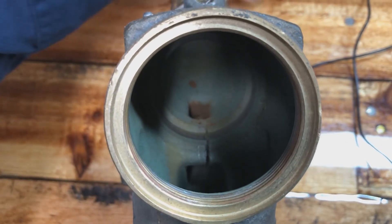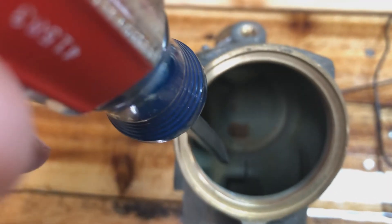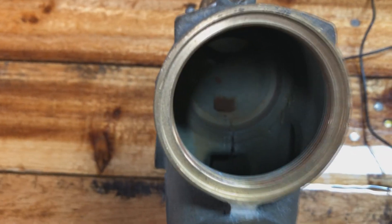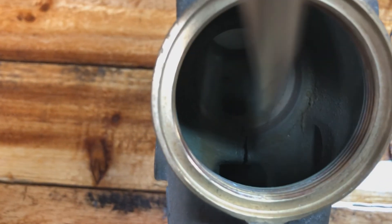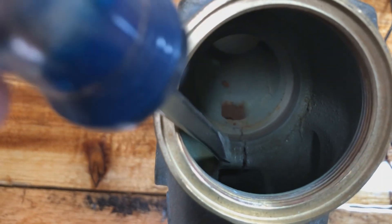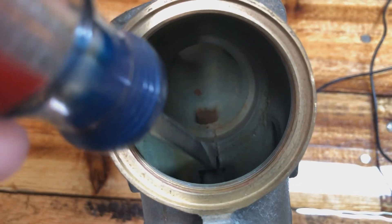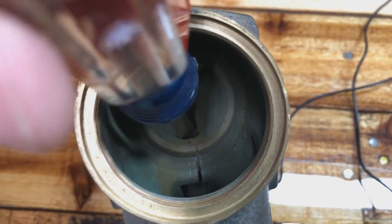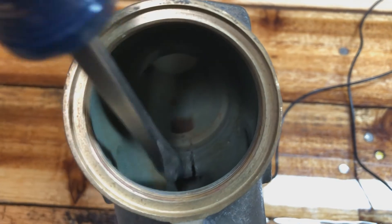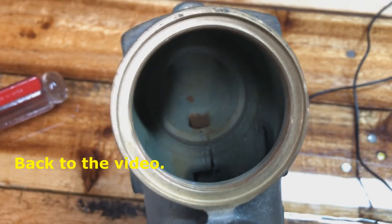Here's a one-inch version of this RP-4A. You can see the green buildup on the housing, which isn't bad in this case. The crack is right here - that's what you want to be looking for. And this hole right here is where the water gets diverted down to the relief valve and pushes that closed first - that's called the internal sensing line. So those are some things to look for in there.